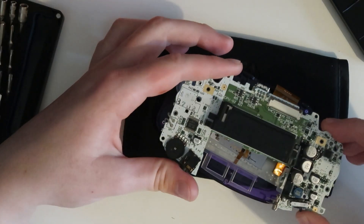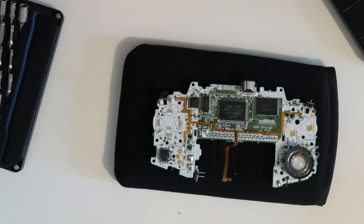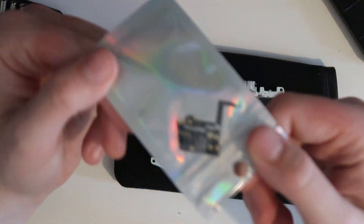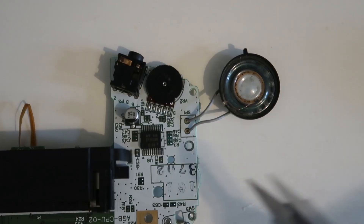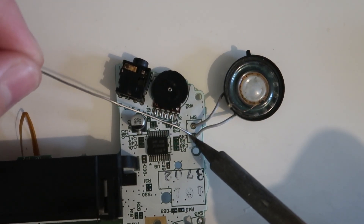This PCB is a flexible QSB. QSB means quick solder board, meaning it lays flat on the motherboard and flows down onto the solder points it needs. This is a great alternative to using wire as it makes for a cleaner install.